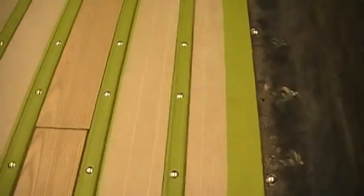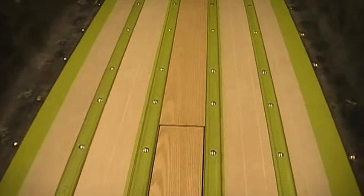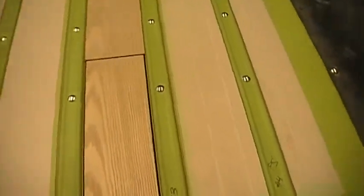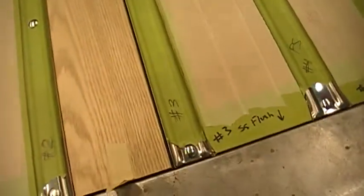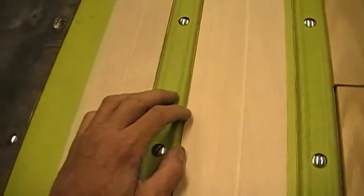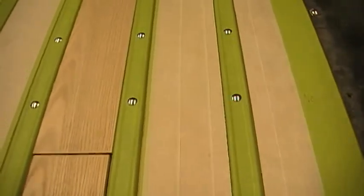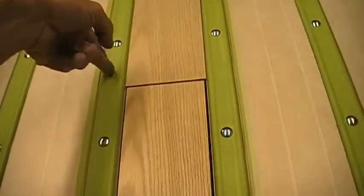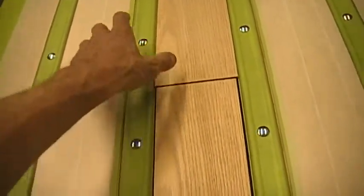Come back out here and let you see what the actual wood ended up looking like. Some of it's taped off for protection, but this is what we ended up with. That's the grain match. The amount of material I lost was ten hundredths of an inch because that's what I gapped it around. A majority of the business end of this is the perimeter bolts all the way around it. These bolts here in the middle are fake — this is actually one solid board, so these are just bolted to the wood. This strip here has a three-eighths gap and a little plate on the bottom side that tightens up, and that's what installs this board.